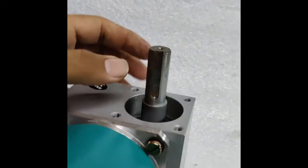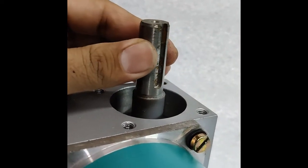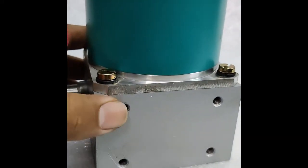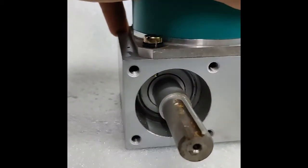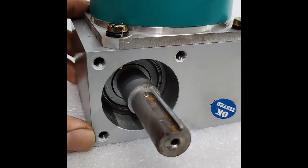It is 15mm diameter and there is a 5mm keyway on the shaft. And now let me show you the mountings. Here are the mountings for the bottom side. It has a 6mm thread and the same threads are placed on the top side of the motor, near the shaft. You can also mount it from here.